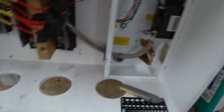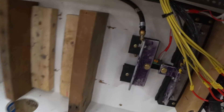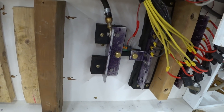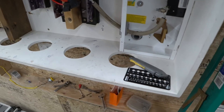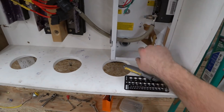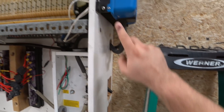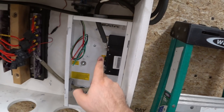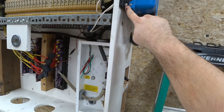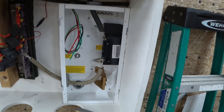So now we are all set — all the connections are tight. This one I was able to reuse one of the original ring terminals. This wire is not touching the edge of the aluminum, which is interesting that you're allowed to have that inside the box given the sharp edge. One more thing: I want to hook up this ground post over to this post. I know that outside I need six gauge wire where it's exposed to elements, but can anybody tell me what gauge wire is necessary for this indoor run? I have plenty of 10 gauge THHN — can I use that? Let me know in the comments below, and thanks a lot for watching.